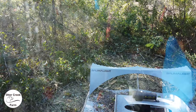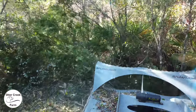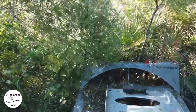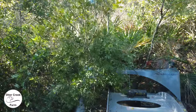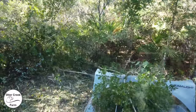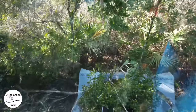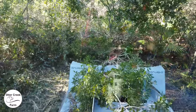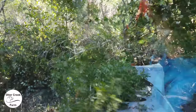Sometimes the bushes I'm backing into might be 12 to 15 feet tall, and there could be a pine tree hidden in there. As fast as this thing cuts through trees — as you're seeing here — sometimes you cut a tree you don't intend to, and the vines will hang onto that tree so the push bar doesn't push it away. That tree can fall towards the tractor. I have had a smaller tree fall on the tractor by accident. You really have to look above the vegetation to spot trees sticking up before you back into them.